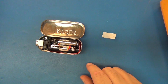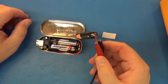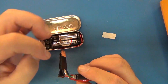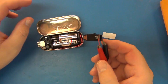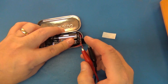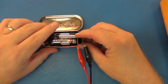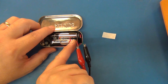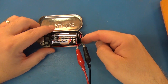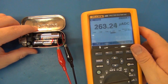And let's measure it. To measure it, you get yourself a two-sided piece of copper clad board and you solder a wire to either side. Make sure you're not going to short out on the can or anything — I used some electrical tape. You just pull it back like this and drop it in, and now you're actually making a circuit that goes from this side of the copper clad through your meter, back in through this side of the copper clad and down. Now we can measure that quiescent current.